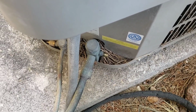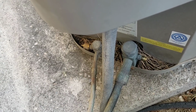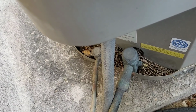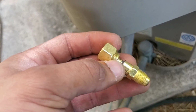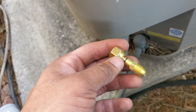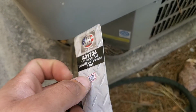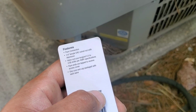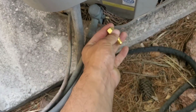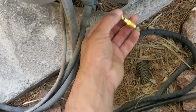The proper way to do this is to remove the entire king valve. I do have a video posted on my channel if this is something that you have to do, but I wanted to share with you something new, and this is a specific tool that you can use if you're having issues with your Schrader valve core removal. This is the packaging that I purchased it in, and basically the instructions in the back just allow you to put this on the outside of your Schrader valve and to secure it, and once you secure it, that will stop the leak.